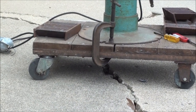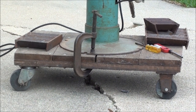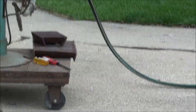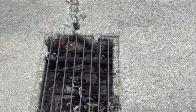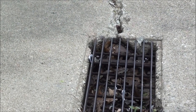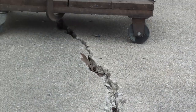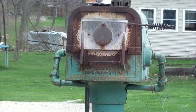My furnace is on wheels, so I can wheel it around. Those are my ingot molds for the extra. I like to work over this grate here, so the concrete doesn't pop. Remember, concrete can pop if you spill metal on it — it draws the moisture out, and there's a minor explosion on the surface that throws shards of concrete. That's another thing to be very careful of. You're better off to work on sand, but I don't have any dry sand.